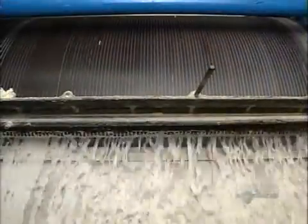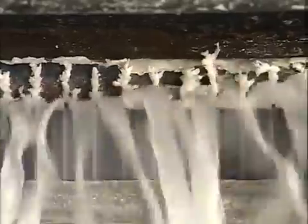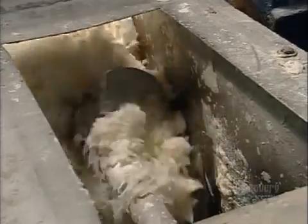Now they spray hot liquid soap onto a big metal roll. It solidifies in a flash, and a big blade scrapes it off the roll, creating ribbons of soap. The soap ribbons plunge into a hopper, where an auger moves the soap along, sending it down a chute.